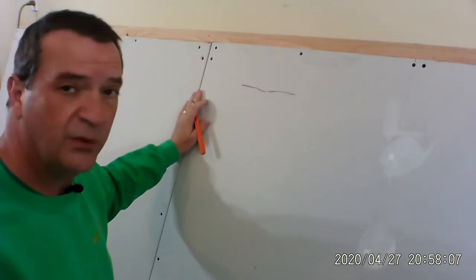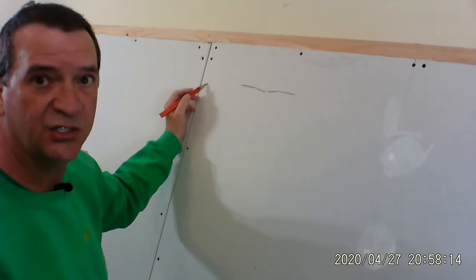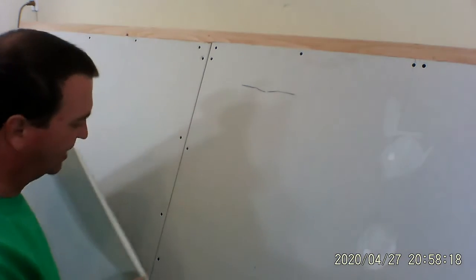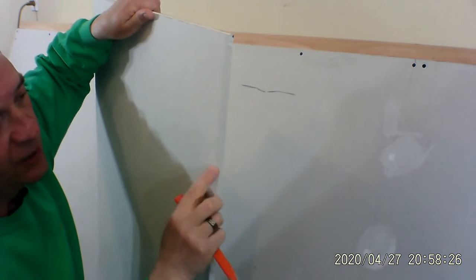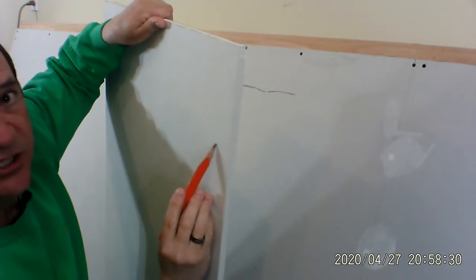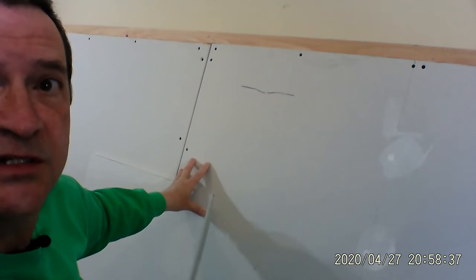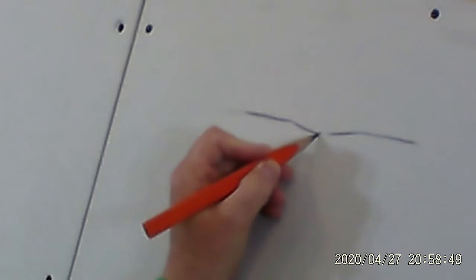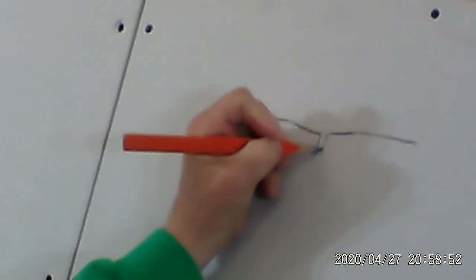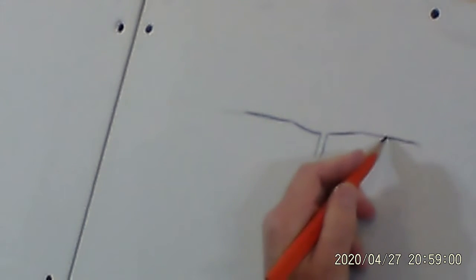Before we went ahead and mud this, when these are put together, they're put together good side to good side. What that means is, when you buy drywall, one of the sides has got a paper coating all the way around it. It also has a little indentation here. I made a little diagram here. The drywall comes across like this, and then it dips down. The other sheet has the same kind of indentation, and here's the other side of the drywall.